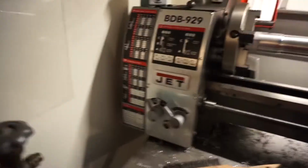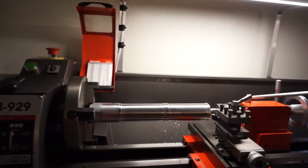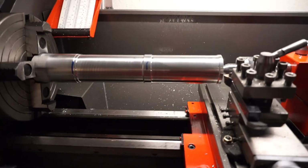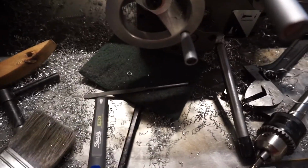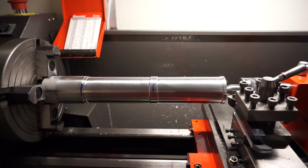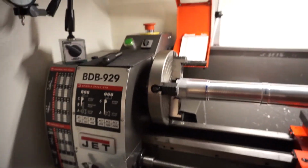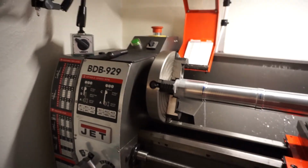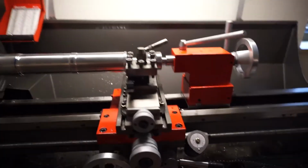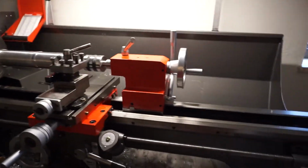Belt life, when I was talking about how skinny it was, yes, it still works. It doesn't actually slip all that much. I actually grabbed hold of this part, 2-inch diameter aluminum, and squeezed it hard with this Brillo pad, about half to three-quarters of my strength, and it only slowed down a little bit. So it's running pretty good speed right now. So it's got some torque. The belt's good. It's just real thin. I think the heat's going to kill it.